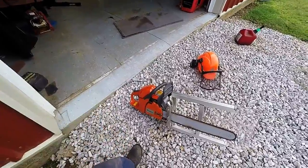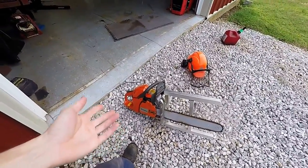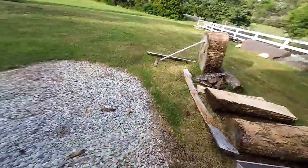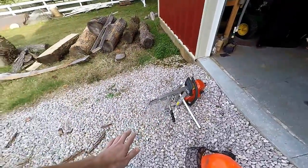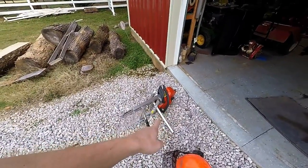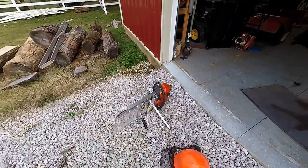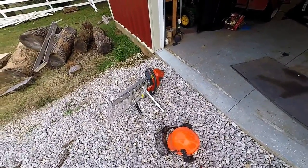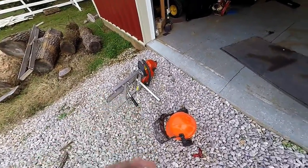It handles it pretty well. I mean, certainly you could always ask for more power, but it does do it fine. Honestly, milling wood like this, this type of wood, it's oak, is really, really hard on a saw. I can get through about 1.5 boards before I have to fill up the oil and the gas. So it does eat through the fuel. It is super strato-charged, which is the supercharged version of a two-stroke, essentially. It gives it fresh air more often, essentially. Cleans out the cylinder.